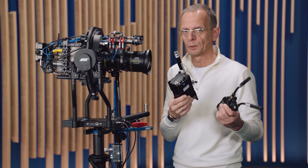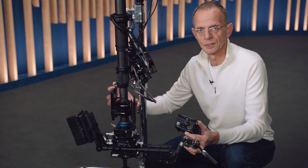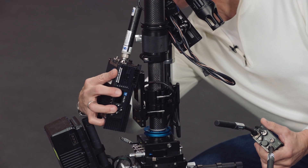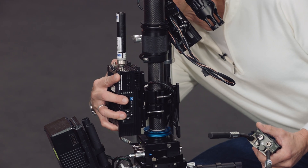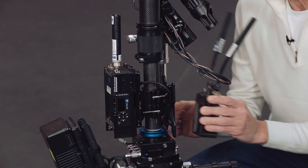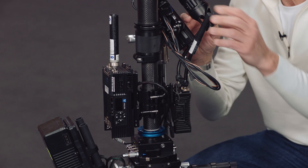The really right way to do it — and this is the Trinity Live way — is to use the weight of the transmitters as counterweight. That's the reason why we mount the transmitters down here. To do so, we also designed the right brackets, which are able to take different transmitter systems. For example, I'm mounting the VisLink in the back, and here in the front I mount the second transmitter for camera control.